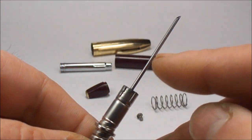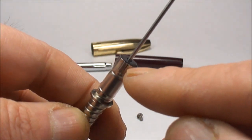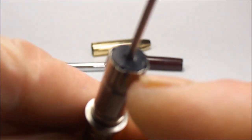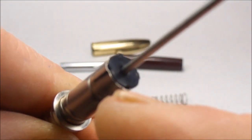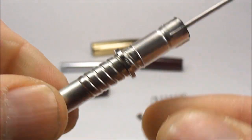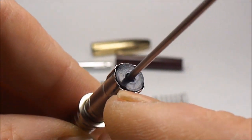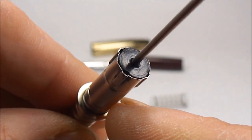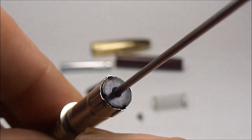To remove the snorkel, it's actually in a little plastic or rubber plug inside there. These sack protectors are generally crimped. I've already opened the crimps up lightly to save time — you've got to be very careful because this metal is very thin and easily distorted. The crimps are in between the guides and we've opened them up so we can take out the snorkel tube.